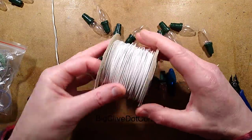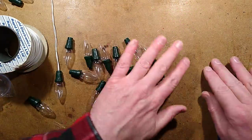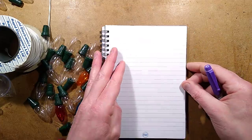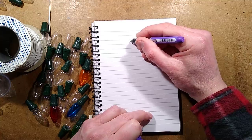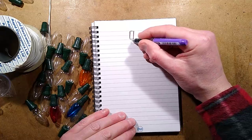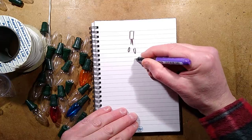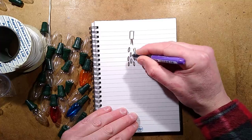I'm going to get white cable. The reason I'm choosing white is it seems a reasonable enough choice of lighting wire, and it's also one I've got loads of. My idea is to make a little Edison screw or bayonet cap insert that goes into a lamp holder, with basically about 20 tails coming out. Each of those tails will have a lamp scattered randomly down - they're going to be in a bunch.